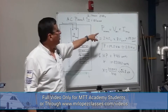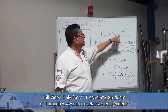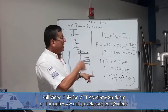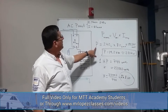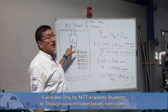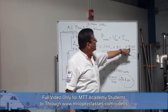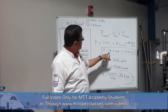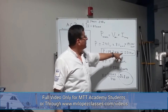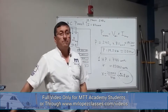The Ohm's law states that the power in watts should be equal to the voltage times the intensity in amps. In this particular example, the power should be 240 times 80, because this is the capacity of the breaker. 240 times 80 is 19,200 — that is 19.2 kilowatts. I can round it up to 20 kilowatts. This is the capacity of the generator that I need to supply power.